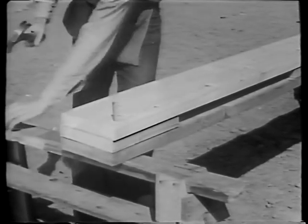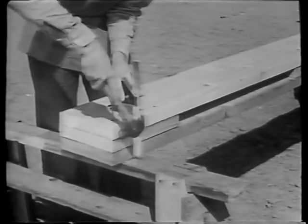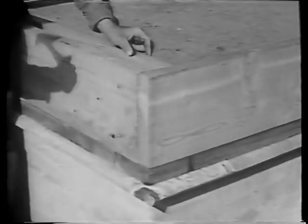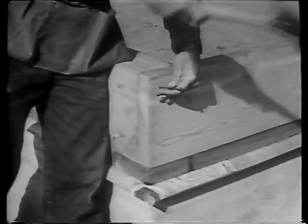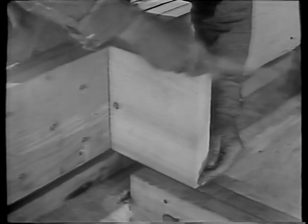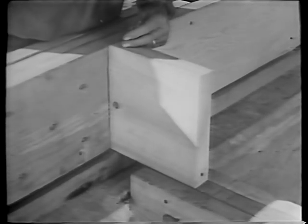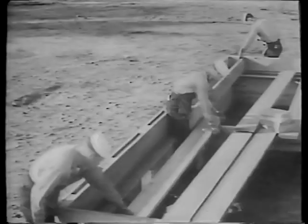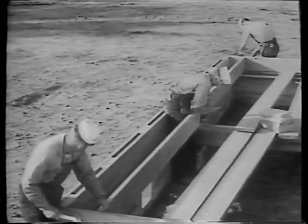We're ready to put in the joists themselves, which have been squared on one end. The double-end joist is first spiked together, filler blocks being used at intervals throughout the length of the joist. They're toenailed in position, and 16-penny nails are driven through the header and into the ends of the joists. Others of our crew have cut solid bridging to length. A piece of this bridging is now placed on the girder with the end of it against the end joist, and nailed securely to both the girder and to the end joist. The next floor joist, with the crown up, is now pulled tightly against the other end of this piece of bridging. The joist is toenailed to the girder and also face-nailed through into the end of the bridging. The ends of the joists are nailed to the header and sills by others of our crew who move down the building with us.